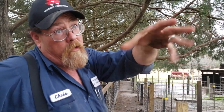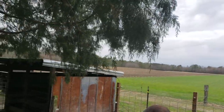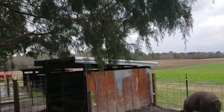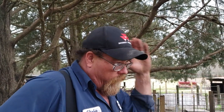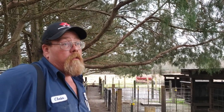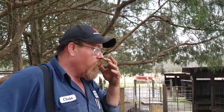On the roof, I put a six-inch drop. We don't get snow hardly ever and when we have it hasn't been an issue. If you have a heavy snow load you might need to go with a foot or two-foot drop so it slides off. For cow shelters, six feet tall is plenty. For hog, goat, and sheep shelters, four feet is plenty — the lower you build them the better, because it takes less material, the wind can't get a hold of them as well. We're in hurricane country so we've got to worry about high winds, and the rain can't blow under as easily. The lower they are to the ground, the better they hold heat in.